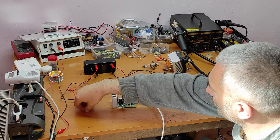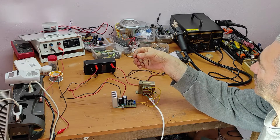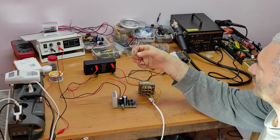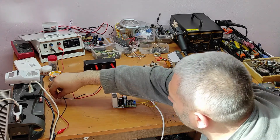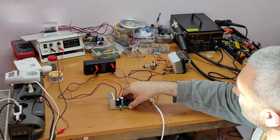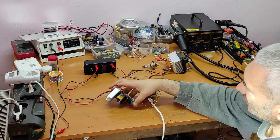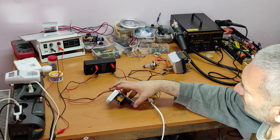There was a small problem: this resistor was not 5 kilo-ohm as it should be — it was 5 mega-ohm, so I replaced it. Now let's make some tests. I have to tell you this yellow part is a resettable fuse.